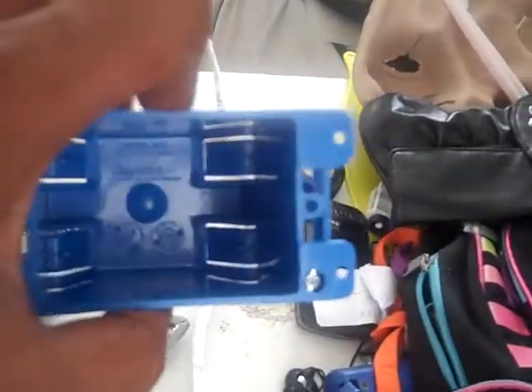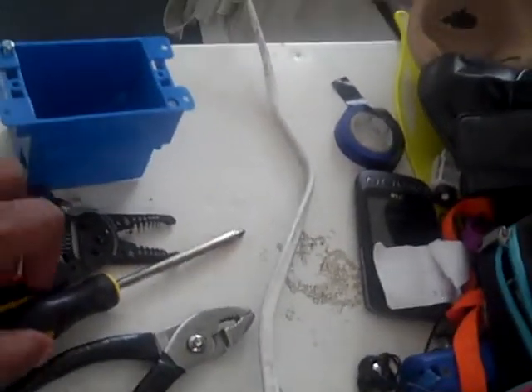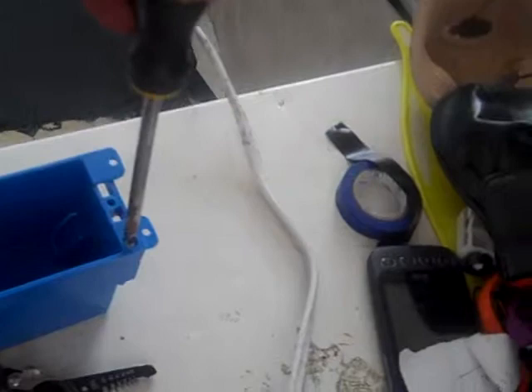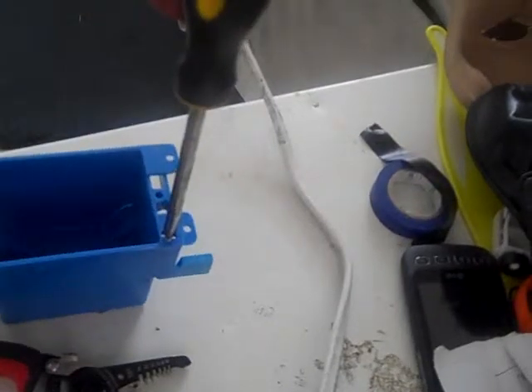Next is your electrical box. This is a very good electrical box. The plastic box you could use for the outside or inside for safety grounding. These boxes are equipped with a self-adjusting mechanism — if you look carefully, as you turn here, that butterfly piece goes upwards. That is what will hold against the back of your wall, grabbing on strongly to hold everything together.